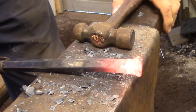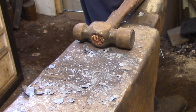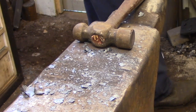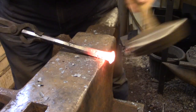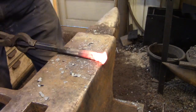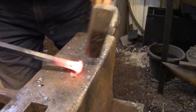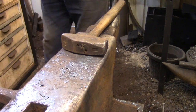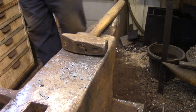It may not seem to be doing a whole lot, but once you get that edge to a point where it starts hooking around the corner of the anvil, things start moving pretty quickly. As long as you keep that mushroom shape under control, it won't curl all the way around and create a cold shut on the underside of the hammer face.